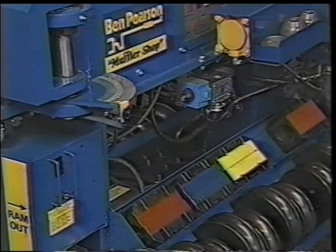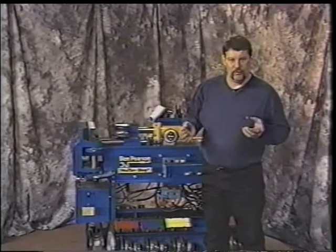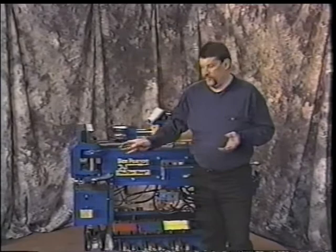Never, ever want to wash your machine. You never want to wash this machine and get moisture down in that motor or the capacitors or whatever. You could ruin the motor. So never do that. Anytime we clean a machine, we take an air blower, we physically blow it off. We make sure that we run the machine as we're blowing it out. That way it keeps the particles from blowing into the motor. The motor's fans actually keep it coming out of the motor. That way you clean all those areas so that it can cool and it'll be nice and clean.